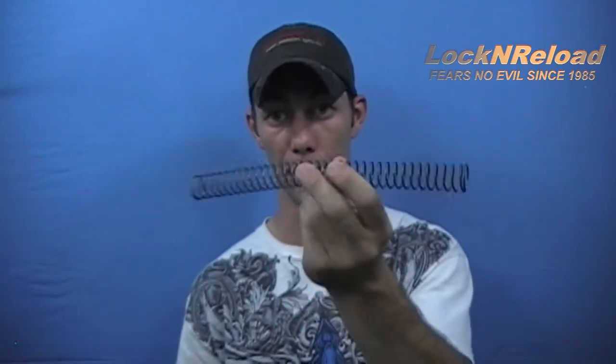The buffer spring is made out of standard spring steel — it's very robust and very simple. It's very TAPCO; I do like the spring a lot. But I don't always care for the recoil spring noise after each shot — you get that echoey sound. The recoil buffer honestly could be a little heavier; it's a fairly light recoil buffer. But it does its job and it does it well. A slightly heavier buffer would dampen a lot of that noise.